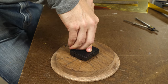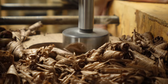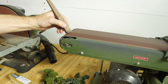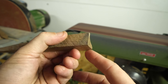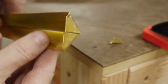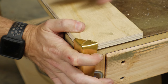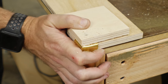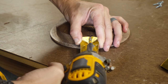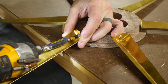I traced the clockworks on the backside and used a large Forstner bit to hog out all of the material so that it would sit embedded in the back of the clock. I drilled the correct size hole from the front using my mark left by the tailstock. I used the curved part of the belt sander to make a small curve in the back of the walnut pieces to fit around the back of the clock. I also used a Dremel to cut off the extra tabs on each brass piece, so there was a nice slot in between them. I sandwiched this between two pieces of wood and drilled a hole to hold a screw. I lined up that hole with the mark on the backside of the clock and drove in a small screw.